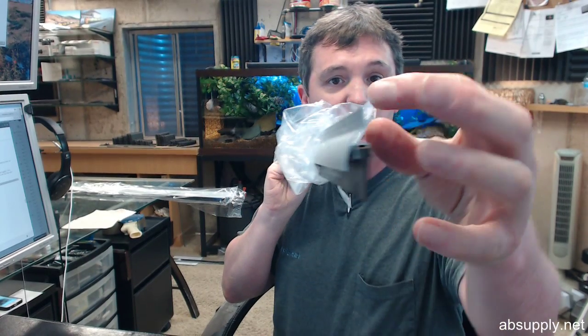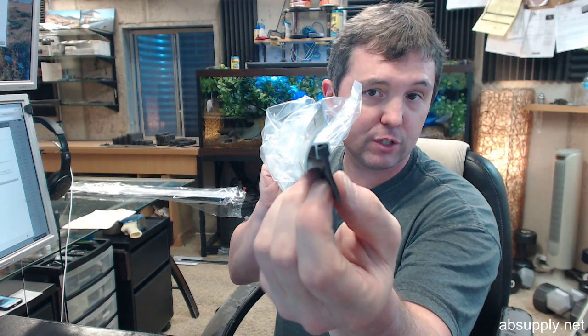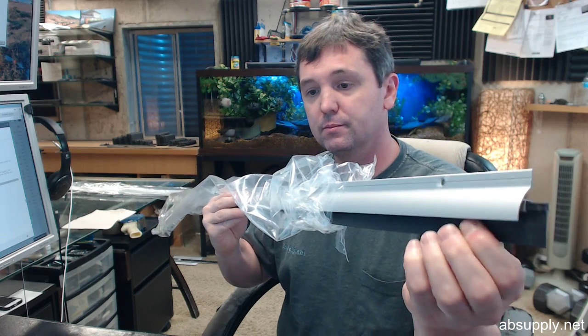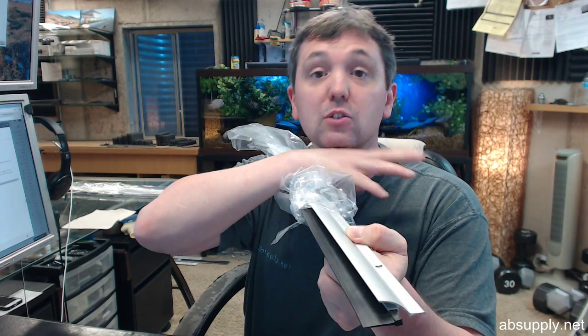The 8197 is representative of the profile of this item. You can see that there is this aluminum extrusion integrated drip cap with the provision for the insert material — in this case it is neoprene, synthetic rubber. Very good, high performance, with excellent extreme temperature capabilities, long lasting, durable.